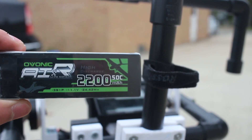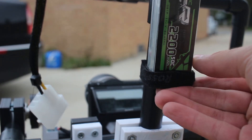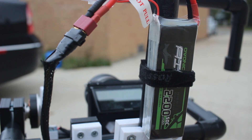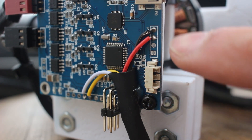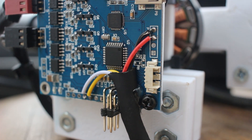I strongly recommend getting the official board because upgrading the firmware is much easier on it. With the clone board, you have to use an Arduino Uno with the Arduino IDE, upload a new bootloader, flash it onto the board, connect it to the Arduino, and do multiple steps. I originally broke the connector for the gyroscope sensor, so I soldered directly to the board and it solved all my issues.